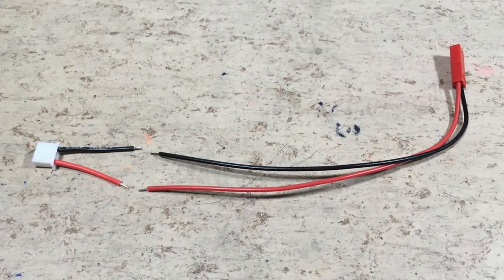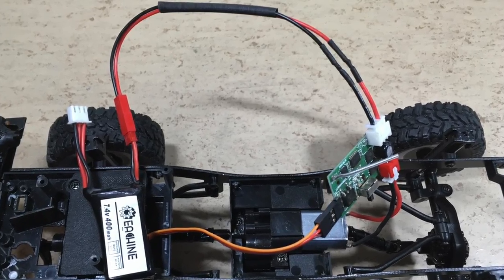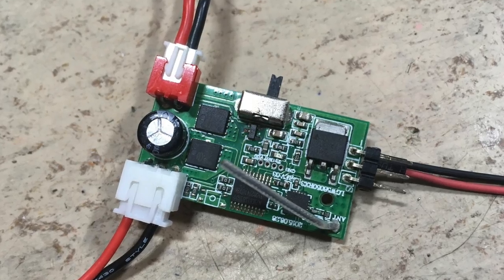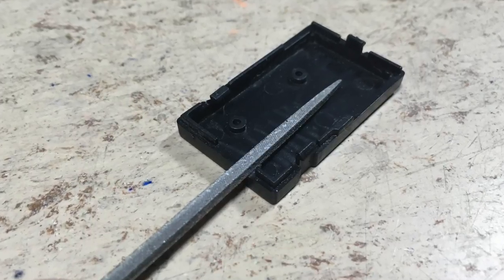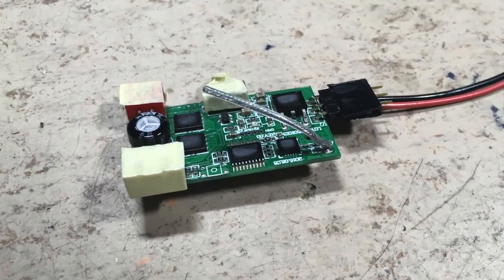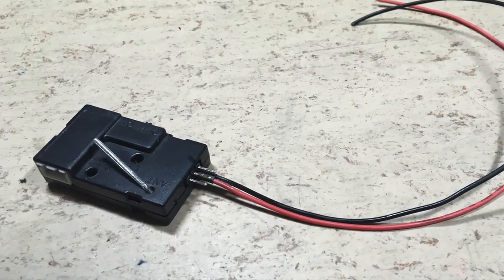The next thing to do is to make the battery wiring harness. The piece on the left came from the K989. This is the test of the battery wiring. Now we want to branch off some 5V wires for the lights. They are soldered to the 5V supply pins of the receiver. This slot is required for the wires. Of course a crawler needs a waterproof receiver, so it is conformal coated. The coated receiver is now ready for reassembling and ready to be mounted in the car.